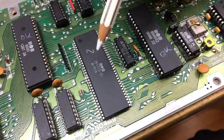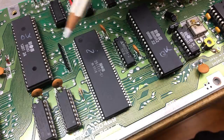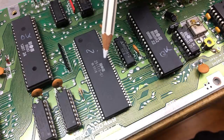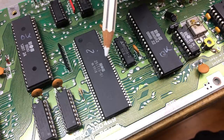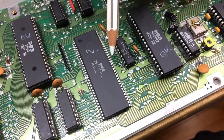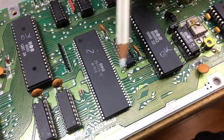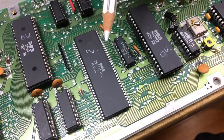very robust. These very rarely fail, but as this board had the burst capacitor in the first place, it might have gotten some serious overvoltage. So I don't know how these chips react to serious overvoltage. Usually they take everything pretty lightly and they don't get hot, like the old PLA chips. But in this case, this is nearly the only thing left, unless I overlooked something. But that may always be the case, of course.